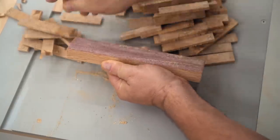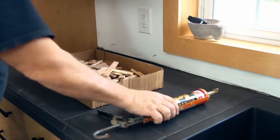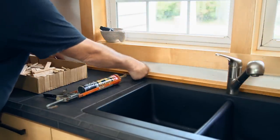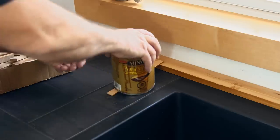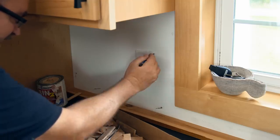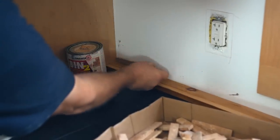Then I can bring them into my kitchen and actually start gluing them to the wall. However, there's one thing I need to do first — lay down a strip that's a little bit thicker than the actual width of the blocks. What that does is create a nice straight line to start laying the blocks from, and I'll move up the wall from there. When that's dry I'll take the strip out again and fill in the bottom.